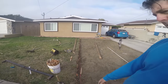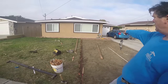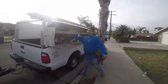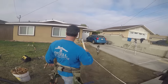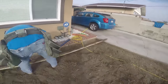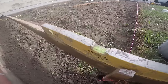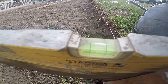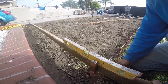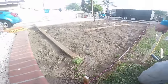One last thing we need to check: we know our elevation is good here because we're meeting the sidewalk. Back here we need to put a level across from the driveway to this — see what's going on. I'll just grab a basic level; I usually use a little two-footer on a 12-foot straight edge. So there's the bubble — I'm right on the string line where I thought I would like it. Right now it's falling back towards the driveway just a little bit, so we'll leave it right there. That's about level with the lawn as well.